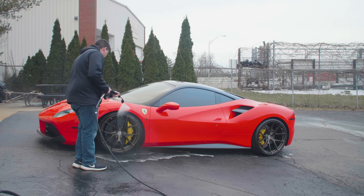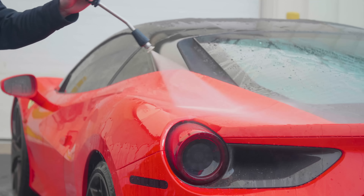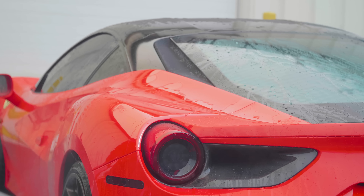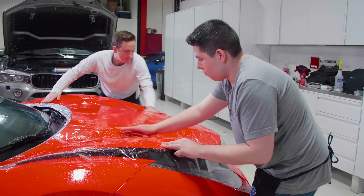You do have to be careful when maintaining it. You don't want to get up close to edges with a pressure washer. We've seen customers come back with a big flap somewhere — we know they hit it with a pressure washer too close and brought that up. If anything starts coming up a little bit and you start wiping a towel across it, you're going to make it worse. If something like that happens, go see your installer. They can do a light little trim on it and you don't have to worry about it anymore.